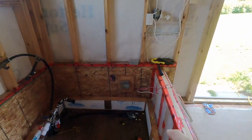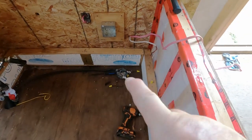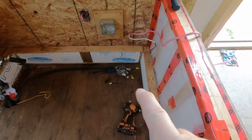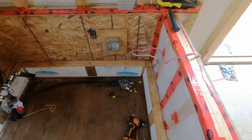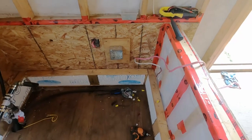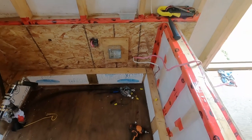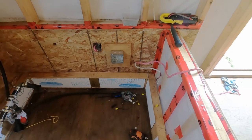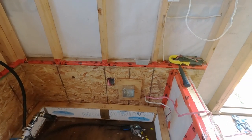So today I'm starting to redo the electrical. What I'm up to right now is in this junction box that's on the deck — I have to take all those lines out of that octagon box and put them in the square boxes on the wall. Some of these circuits, well they're all dead except for one feed, so I have to find that feed and disconnect it so that I can tie everything in. I'm going to do that and when I come back I'll hopefully have them all in this box for you.